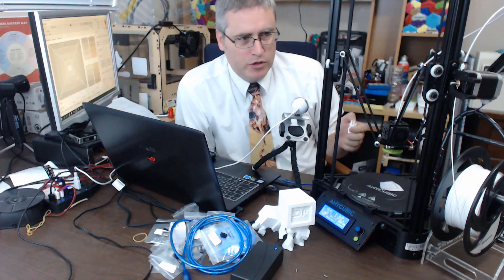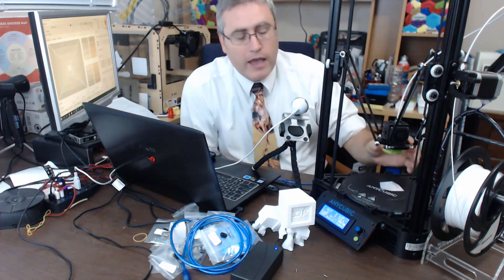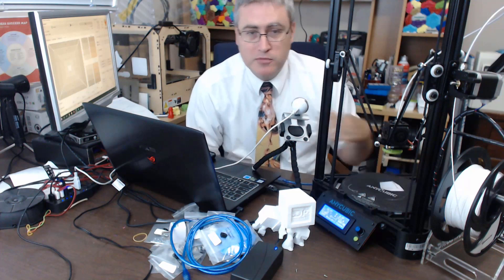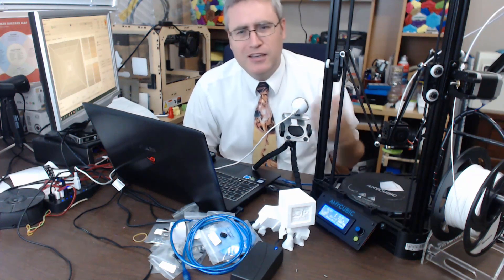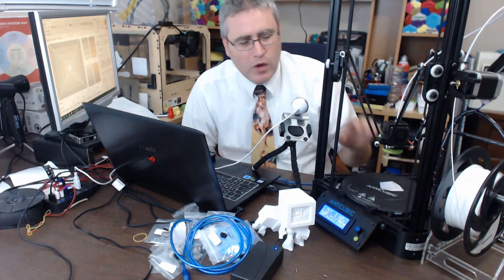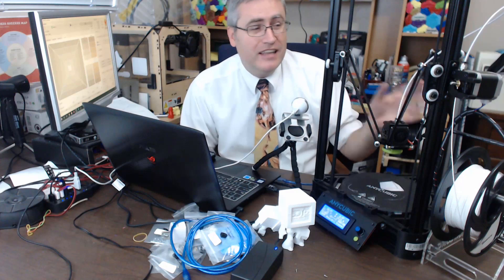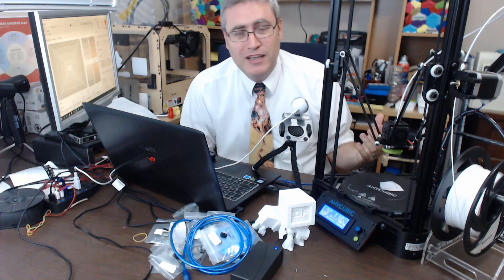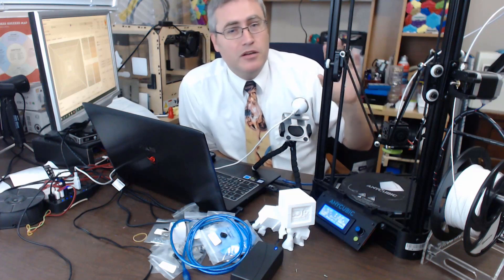I think what I did next was print a new fan for it. I have to mention that because my Kossel was having problems, I printed this on my Replicator. I used a high-temp plastic since it sits right next to the nozzle — in this case PET, though ASA could also work. This printer needs a lot of work right off the bat. In my experience, it did not produce good enough prints to print its own parts yet — which is kind of sad, but it was still an amazing project.